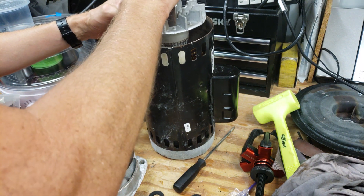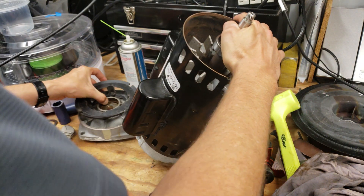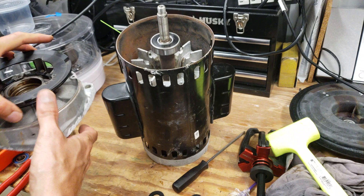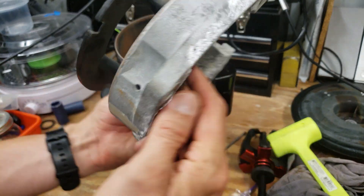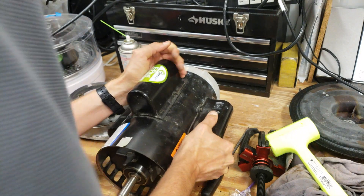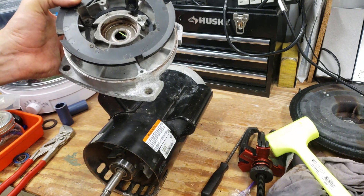First, drop the core down in here and make sure that the bearing seats okay in the bottom. This top cover has a little catch for the bearing, so make sure that's screwed in place — it'll stay open and then when you start to tighten it, it should rotate around and come to a stop and capture the bearing. There are some washers and little spacers down in here; just leave those in there lubricated. There are spacers on the other side too — wave washers at the other end to take up any tolerance.